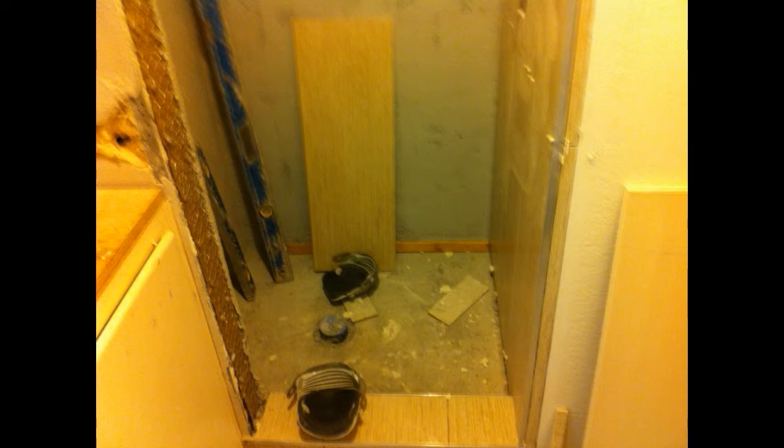If you've got a flat wall, especially with a mortar bed, I can make that wall flat. It just goes up so easy with 1/8" spacers and wedges. Now I'm putting in the Schluter and I cut a piece of tile for the side there. And as you can see, it's just going up. It looks beautiful, man. Look at that. It's satin finish for all the plumbing, so I used an aluminum Schluter piece for the trim to match the plumbing.